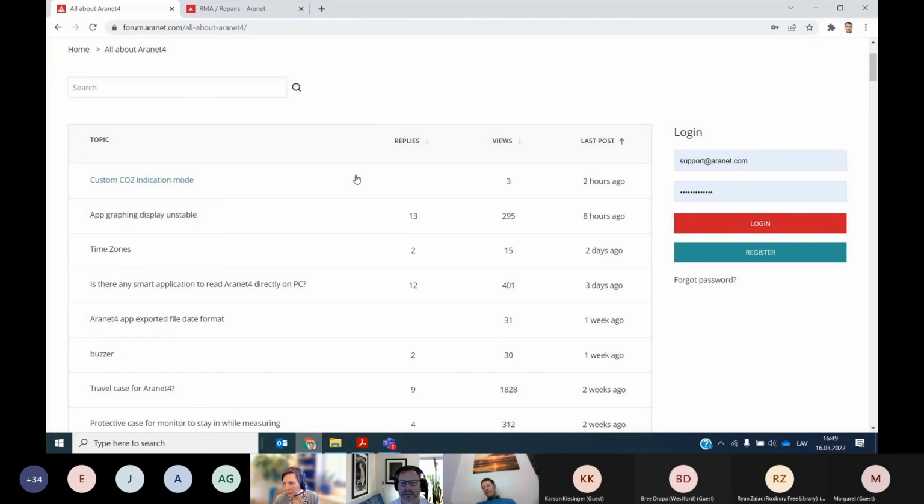You basically just want to think about where the people are and where you want to be monitoring. If there's a room that doesn't have anybody in it, your chances of having high CO2 levels are really low. The device is made so that you can test the safety of the places where people are going to be. If you put that device right in front of someone's mouth, that's not going to be an accurate reading of what that room is doing. But if you put it on a wall in the room where people congregate, as centrally as possible, that's probably going to be the best place.